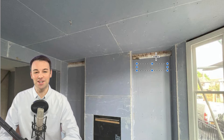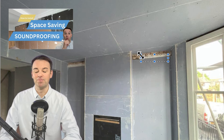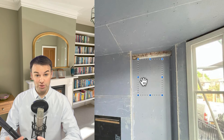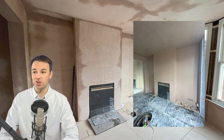Some of you might have noticed we haven't done the whole wall — how come we've only gone up to a section? When you have an old terrace property, sometimes there's a little concrete nib. We've soundproofed up to that concrete nib because in this case we're going to install a bespoke coving, and if we went over that nib it just wouldn't work with the coving. The homeowner didn't want to lose any more space, which is why we installed the 100 mil system that fitted nicely with those nibs. Whilst the room was being plastered, we also went up into the rooms above and soundproofed the floor.